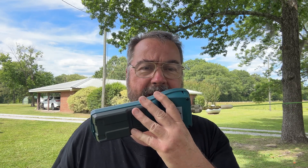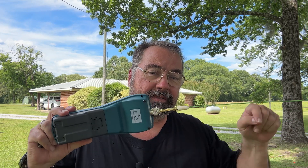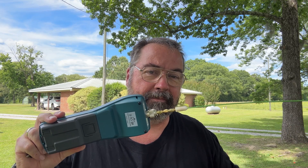I'm using a rig expert for this video — not an actual radio. Does it make any difference to hold your antenna straight up when you talk on your HT like this? Or do you need to be all gangster and talk sideways — is that better? We're going to look at SWR. We can't really look at power in this video, but the lobe on the antenna goes out from the side, not from the end. So I'm pretty sure that when you turn this thing sideways, half your power is going straight into the ground anyway.